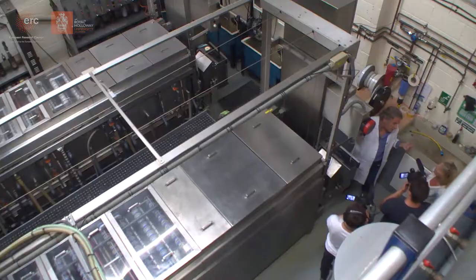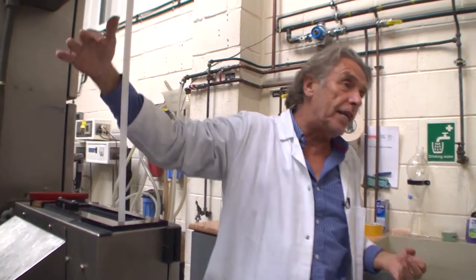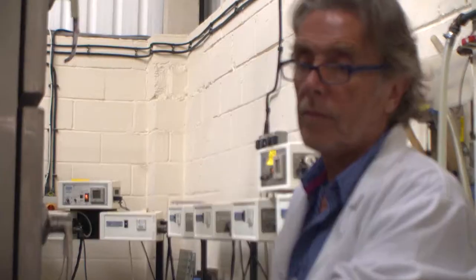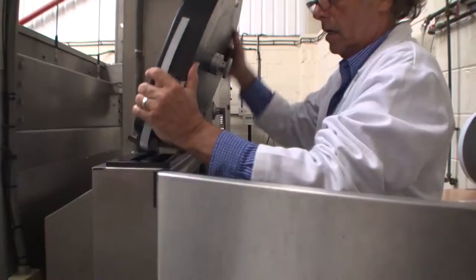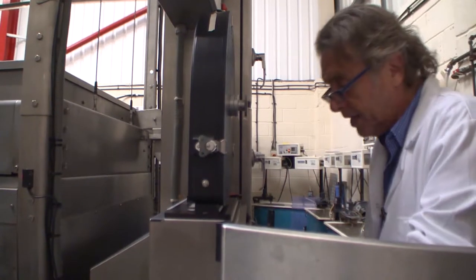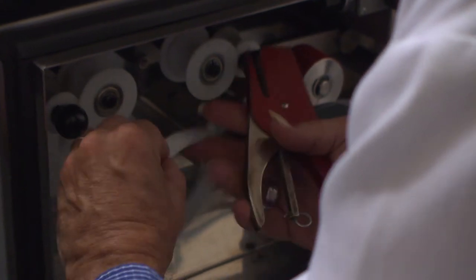This is the load end of the machine. The film is still kept in light-tight conditions and will remain so until we get into the bleach. We're going to join up the first magazine of exposed camera material that we've just made up in the dark room. There's a finite amount of time to make this change — these lights alert the operator to where the elevator is. There are staple joints which have to be done pretty specifically.